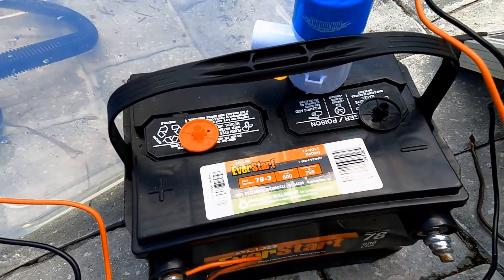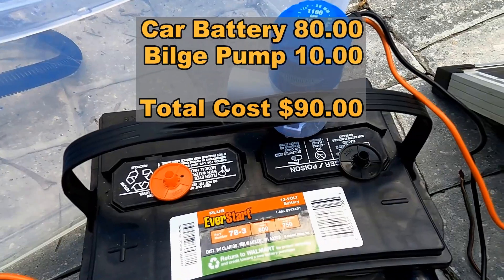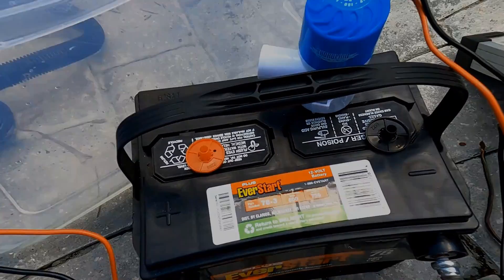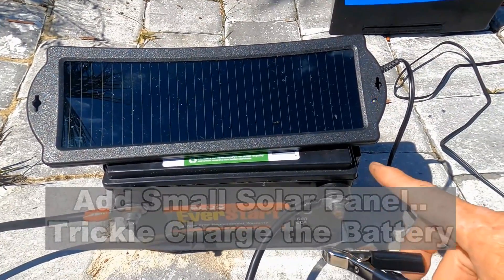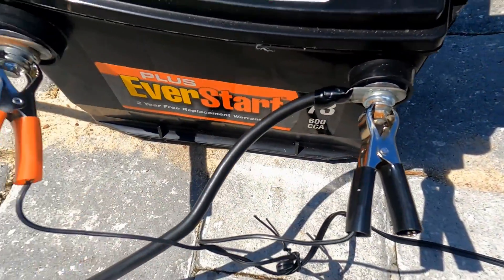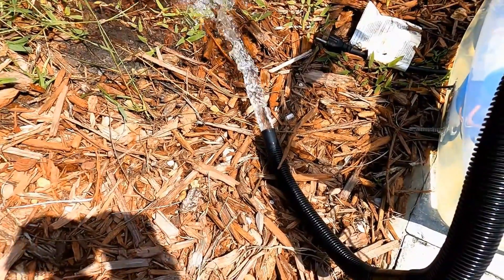This battery — a brand new battery, they're like $70-$80. Bilge pump, $10. So there's $80-$90 altogether. And that little guy can save you from all that aggravation of having water flood into your house — your slab, your crawl space, your basement, wherever you live. This is a great way to go. This little panel — I think it's 15 watts, just a trickle charger — I think they're $17 at Walmart. If you hook this up, when you have full sun, it's going to keep that battery charged. Most new car batteries have about 100 amp hours of power, so that's a long time — but you can extend it by adding that little trickle charger. This is Chuck with Apple Drains reminding you that if you believe you can do something, I guarantee you can do it. Have a great day.